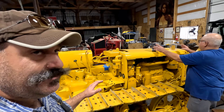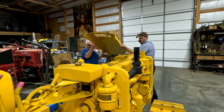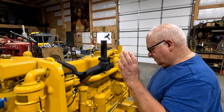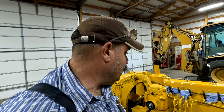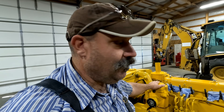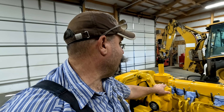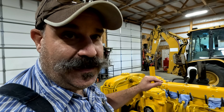We're going to pull the hood off and get those injectors in this fender-bending beast. I checked our oils — nothing's changed. We're debating where to put our best injectors. We have two that are really exceptional, and I know the back of the engine gets the most heat, so I think I'll put the two really good ones up front where it cools a little better. We'll put the best ones from front to back — dad's going to write down which cylinder each one goes into.